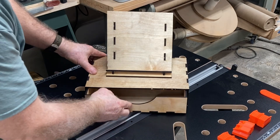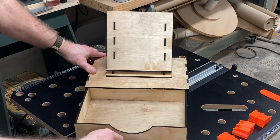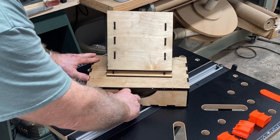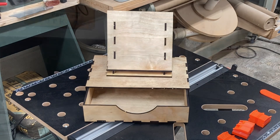Using this method allows me to really go through the scrap bin. You can see where I've already cut some items — I had material left and could place another portion of the project on it and continue using up the scraps. In the end, these projects — you would never know — were made from just scrap material left over from other projects. You're not limited to just these types of projects. Many of the different laser projects I have done, and the ones you see on the wall in my shop, were all done using this method. You can do simple engravings, cutouts, or make boxes — it's all up to you and your creativity. Using the current position in Lightburn is a great way to do it, and it's very simple and easy.